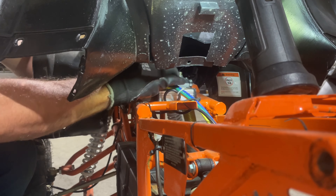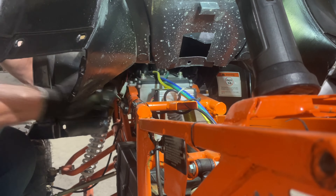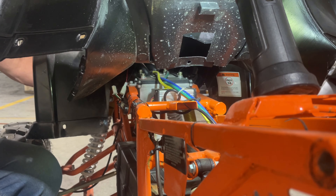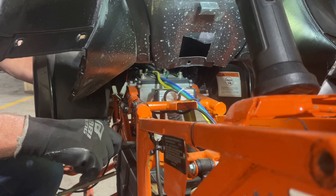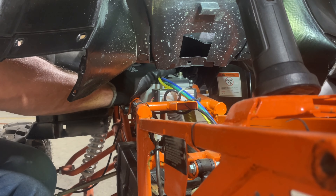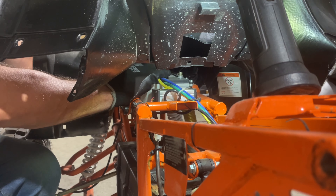This is our power wire right here — I just want to loosen it off. No joking, guys, there's a lot of current going through this battery. If you let this power wire go and it touches anywhere on this controller or anything, it's going to give a mighty zap. Every one of the batteries in this battery box is 12 volts, so that's basically what you have in your car — and there's four of them. Line them all up and you're going to get a good discharge. I've almost blown a hole in my thumb, so you want to be careful. Once you've got it off, just hold it in your fingers — it won't hurt you. I wouldn't do this with wet fingers. Don't do this in wet bare feet, because then you're going to get an awful surprise. If you have rubber-soled shoes on, you can hold on to the wire.